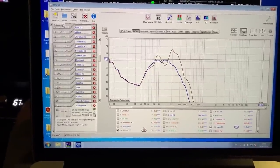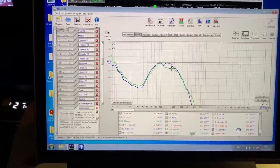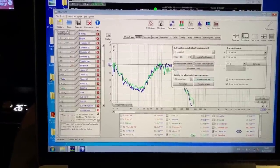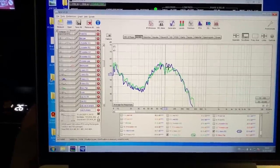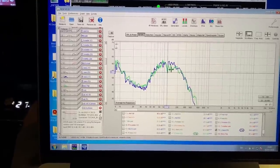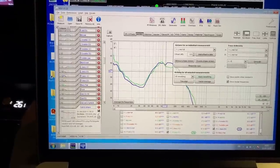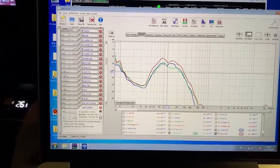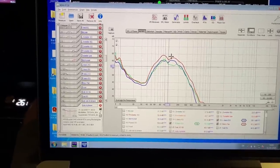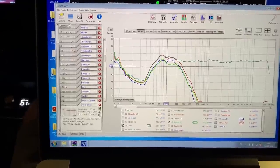From that we end up with right bass EQed. I couldn't get rid of one area completely because there's a huge cancellation showing up at around 115Hz with finer resolution — it's a cancellation that appears on both side drivers and no matter how much EQ you push into it, it won't come back. No point worrying too much about it. They end up looking similar, and when they play as a pair it's alright, but that cancellation will appear in the pair measurement as well.